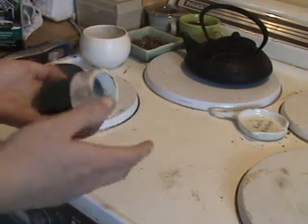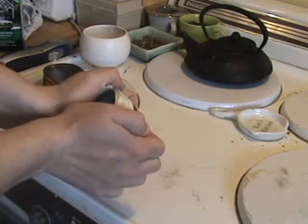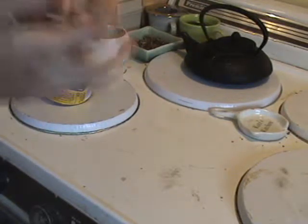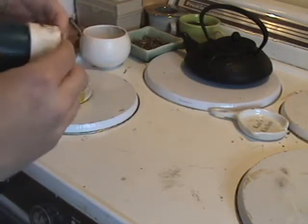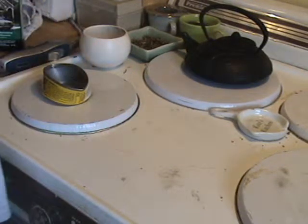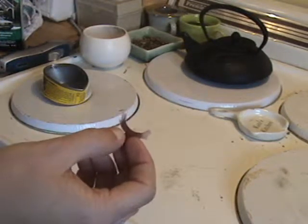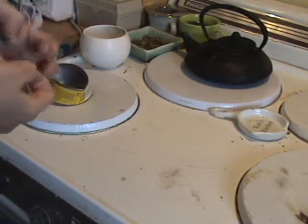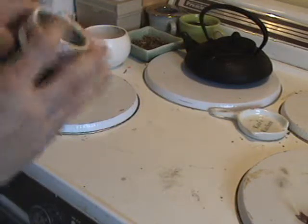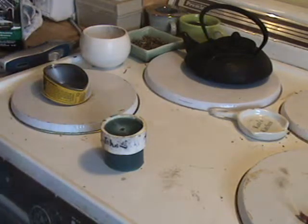First thing you do is you prime the mold by slipping the PVC cylinder over it. You want to make sure you get this all the way down onto it. Otherwise, air will get in through the side of the mold, causing very nasty air bubbles within the ring. The ring will fail, as you can see there. This was caused by 2 air bubbles. Now we are going to continue getting this as far down as possible to where you have a nice stable platform.